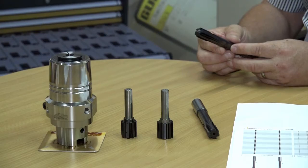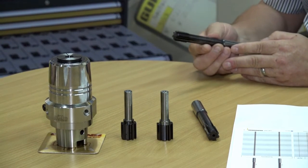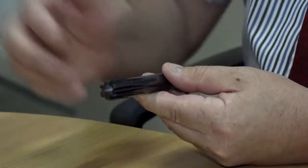Is that purely the coolant or is it the coating as well? It's a combination of things. You've got the carbide grade, which is a very wear-resistant grade. You've got a super AlN coating — an aluminium nitride coating — which gives good wear resistance on the cutting edge. And you've also got the benefit of the through-spindle coolant clearing the swarf as well.